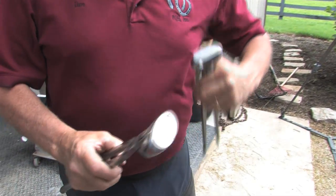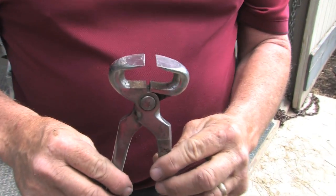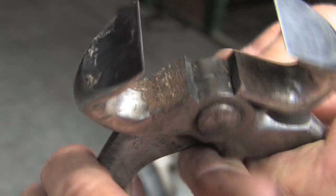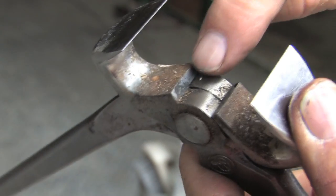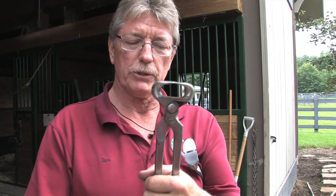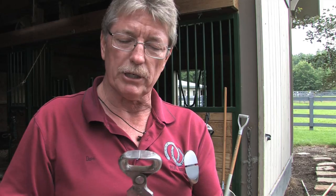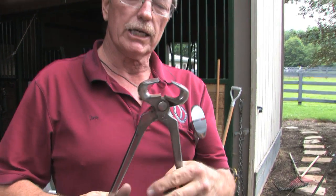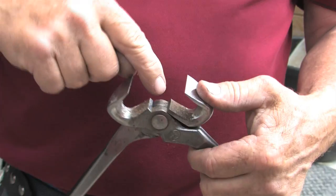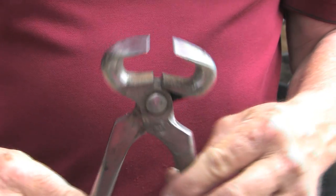The set that I've been using for about a year, as you can see, they're still in pretty good shape, but what happens is you get a lot of debris and dirt down in this area. That needs to be kept clean. If it's not kept clean, you catch yourself squeezing the tool really hard with your hands to try to make that cut all the way. It's not that the nipper is out of balance or needs to be sharpened — it's just that this foreign material keeps you from getting it closed. Daily you should check this to make sure there's no debris and enough oil on it to work smoothly.